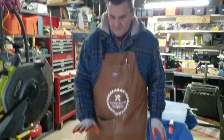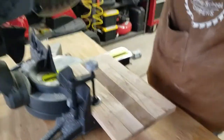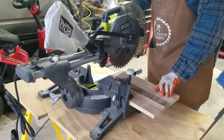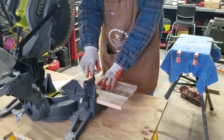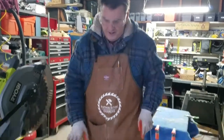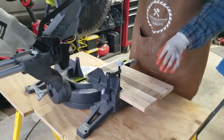Now I've taken the clamps off, but because I wasn't completely square I've got to cut off and smooth the edges. I've got a sliding compound miter saw — it pulls out, we can cut it and slide it back, and that's going to square off the edges. I've put the cutting board on the saw base; before we do anything with power tools I'm putting my safety glasses on. Power's plugged in, hands out of the way, fired up.